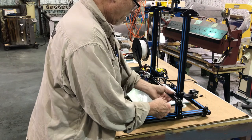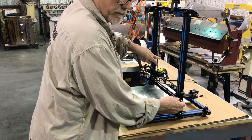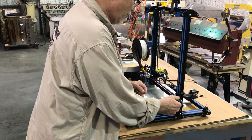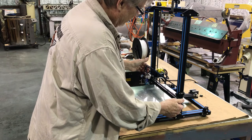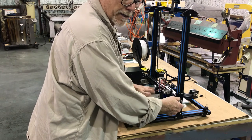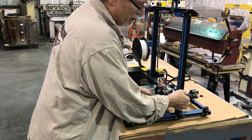This wheel right here is loose. This is your X beam, and all the Z motion is pushing up on this beam — pushing up on one side. This is a single Z lead screw, and when you're pushing up on this with nothing supporting the other side, you can see a problem. Imagine the weight of this coming over and exerting more weight on this side of the beam — you're going to push down and get irregularity in your Z layers, which is a very important part of your print.